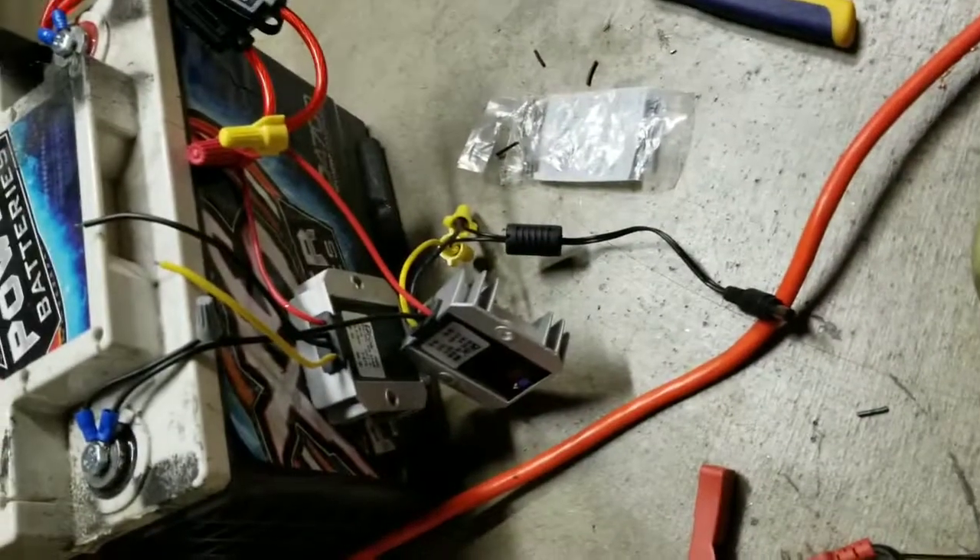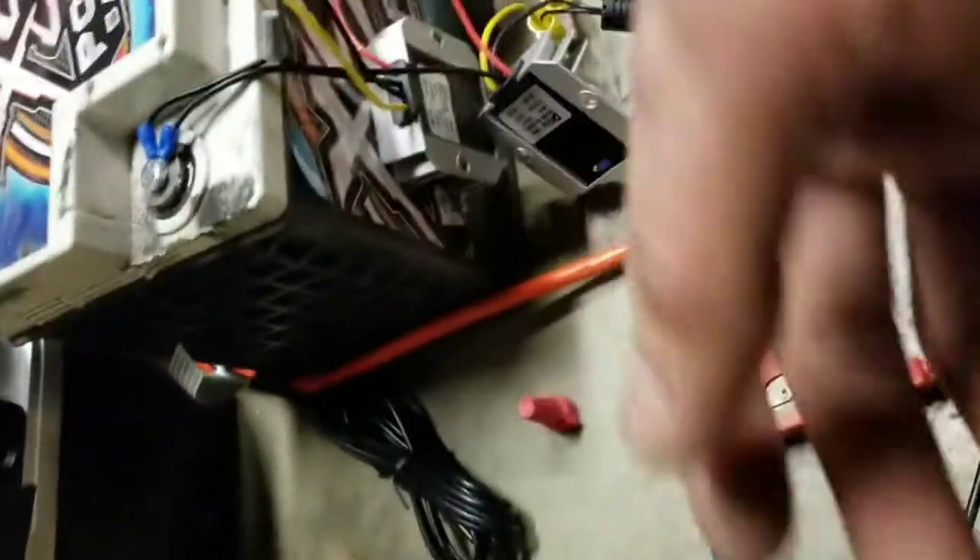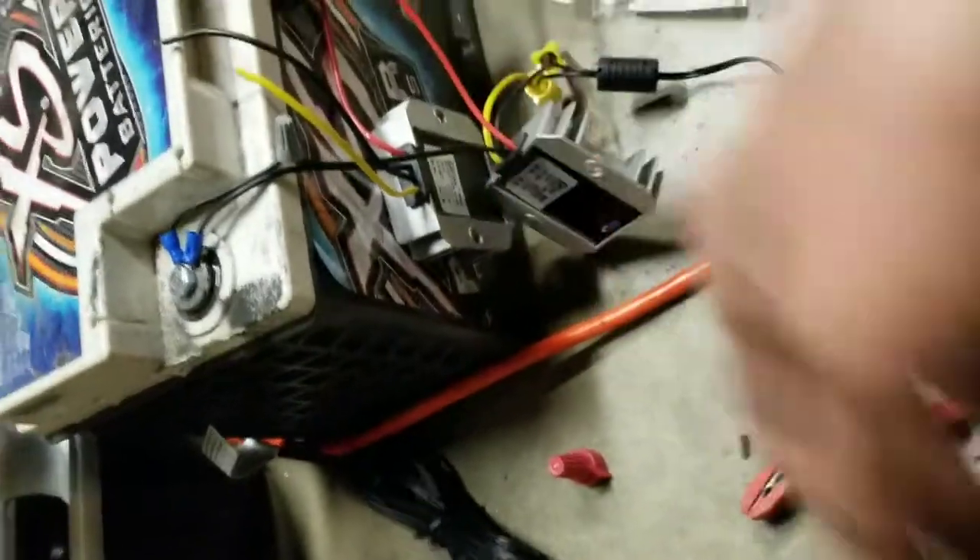It's powering four cameras. Somehow I doubt they're all taking 500 milliamps, because those aren't even running hot. So let's say 250 milliamps each — it's probably pulling an amp — but realistically, to be safe, I've got the amp headroom.